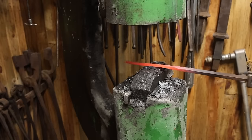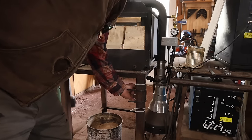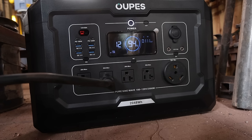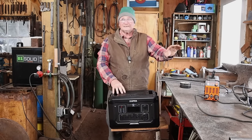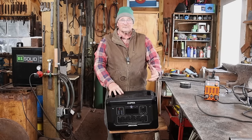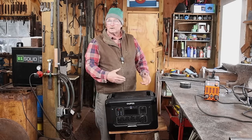It runs the 25-pound Little Giant quite nicely. Should be absolutely no problem running the blower on the ribbon burner forge. The power draw is 112 watts with an estimated 12 hours of battery capacity — you could work all day with a ribbon burner forge using this. My big question is whether this thing would run a little 110 welder. Power-wise it ought to do it, but welding off a battery bank still seems like it shouldn't be possible. I'm going to try it anyway.